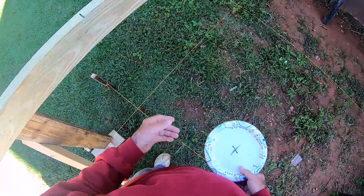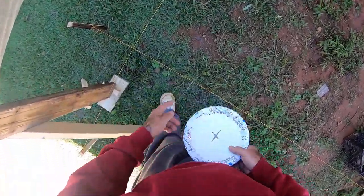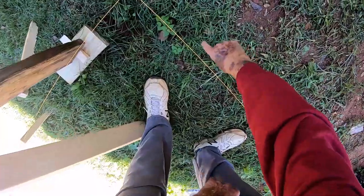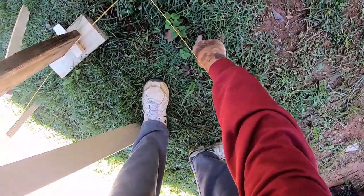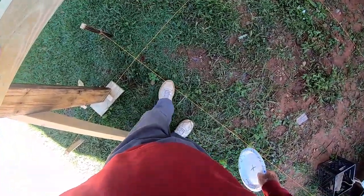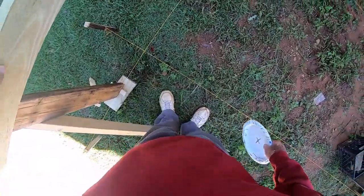Now, since I'm going to cantilever it, I wouldn't put the outside leg of the beam support post right there. I'm going to move it in 12 inches. So I'll come in 12 inches, center a plate right there. And that would be the middle of the hole. You can see I got a hole from my old deck right here that never got filled up. We're fixing to throw some dirt in that.